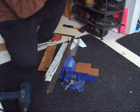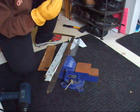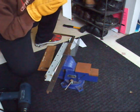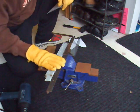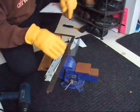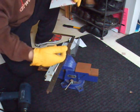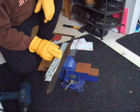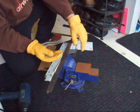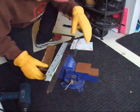On a thicker piece, if you make your line on the inside or the outside, when you do your bend you're not going to get that exact same line. I took a small scrap, made a line, put it in my jig, heated it up, bent it over, and realized that my bend is going to be a quarter inch above the line that I make on the inside.